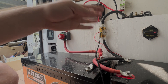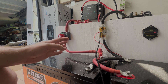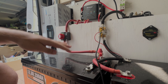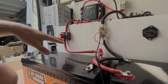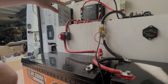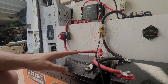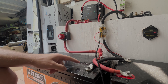For the cable size, I went with 2/0 (two-ought) cable for the batteries. These have a higher amp rating — there's going to be a lot of amps that could be pulled out of the batteries. It's very important to make sure your cable size is rated higher than the actual amps you think will be pulled. It's better for your fuses to blow before your actual cables — it's easier to replace a fuse than a cable. The thicker cables coming directly off the battery are 2/0.